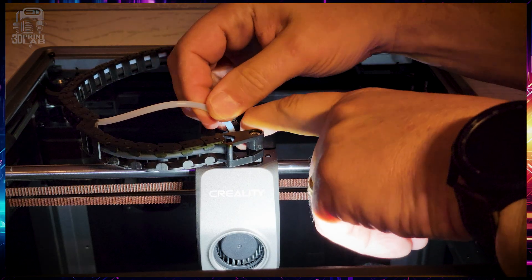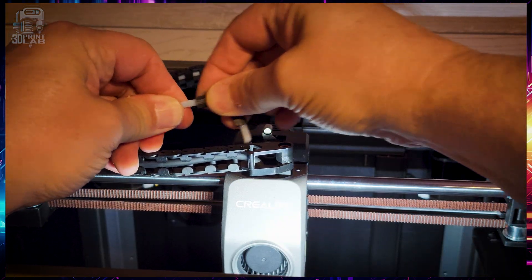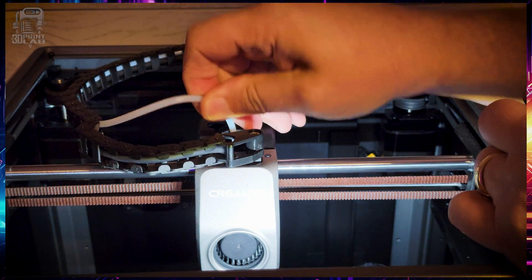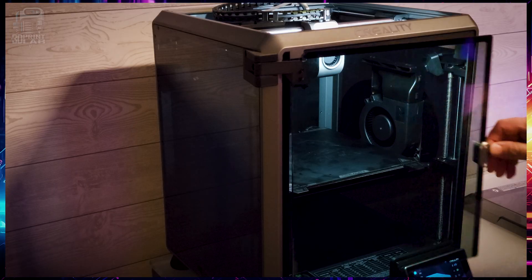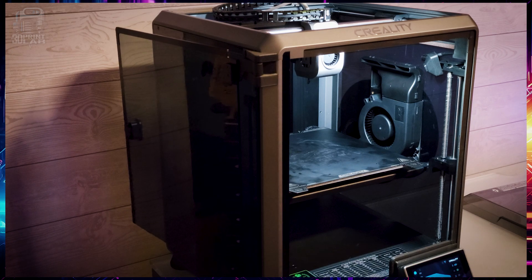In regards to loading filament, there's still some work to be done. Pushing the filament through the tube isn't an issue, but for some reason it's almost impossible for me to get the filament to go into the extruder properly. Wiggling the tube around works occasionally. I even tried printing a little add-on that fits over the end of the tube right up against the connector — it also works occasionally. But when none of that works, fortunately it's pretty easy to release the tube, push a little extra filament through and into the extruder, and then push the tube back into place. I also printed out 270-degree hinges and swapped them out with my door hinges, which allows me to swing the door completely open, giving full access to the inside without feeling like I might break the door by pushing too hard.